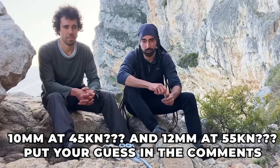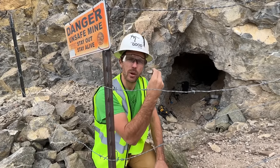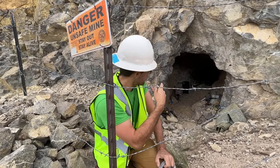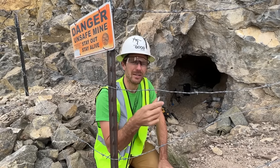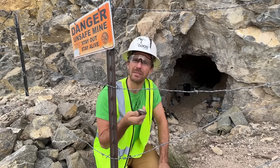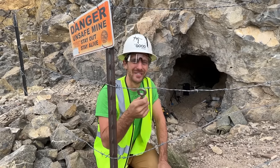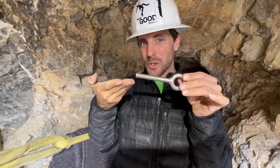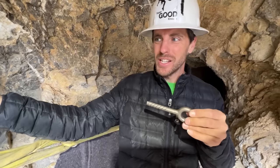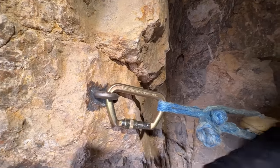We came to Nevada and installed bolts into the sidewall in the best rock we could find, with our hydraulic in the back pulling away from us. To be safe, we're not going to be in the pull zone while breaking. After each break test we run in and check the result. We have a forged eye bolt connected to our hydraulics — starting with the stainless, then going with the zinc plated.